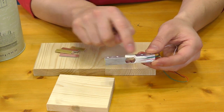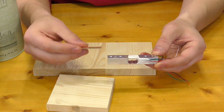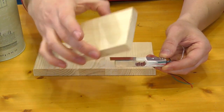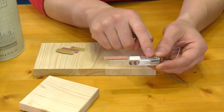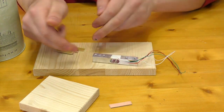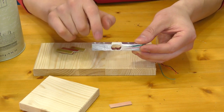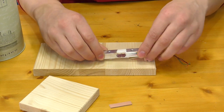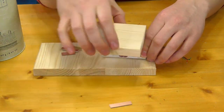You want to make sure that your platform doesn't touch the other side, because then it would be putting weight there and wouldn't be able to measure that weight. So I've cut some very thin strips of copper clad, and I'm going to glue those to the top of the load sensor, and then glue the platform on top of the copper clad. That should stop it from touching the load sensor. You also want to make sure your load sensor doesn't sit flush with the ground, because the pressure will go through the wood instead of the cutout points. So we're also going to use a piece of copper clad on the bottom of the sensor, so that when the sensor sits on the wood, there is a gap underneath that allows the load sensor to detect the weight of the platform.